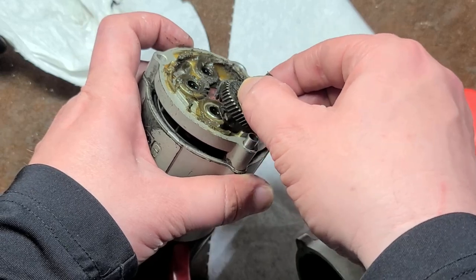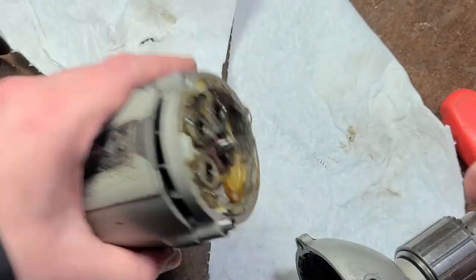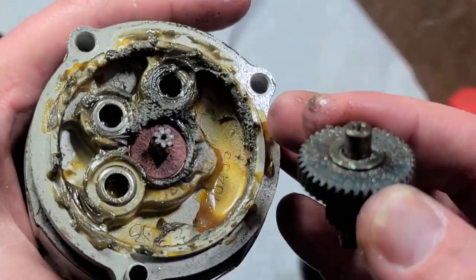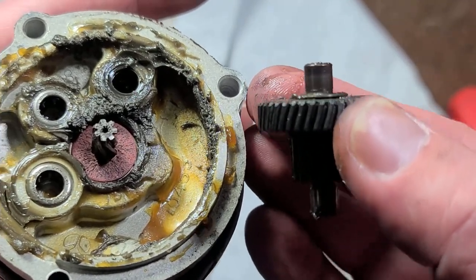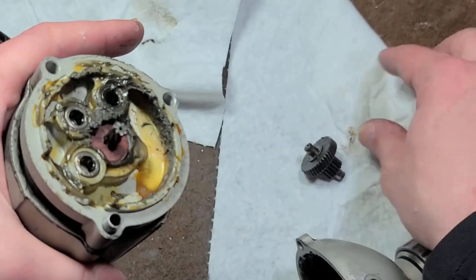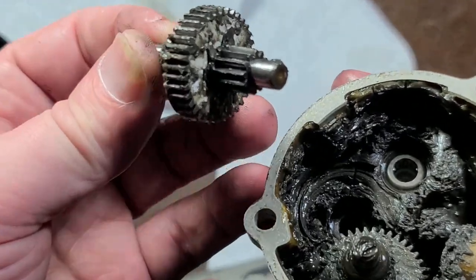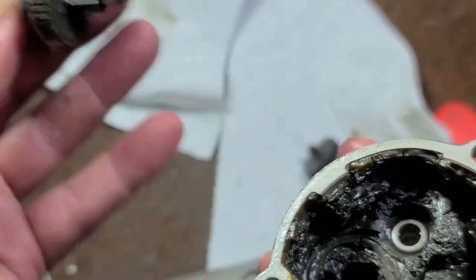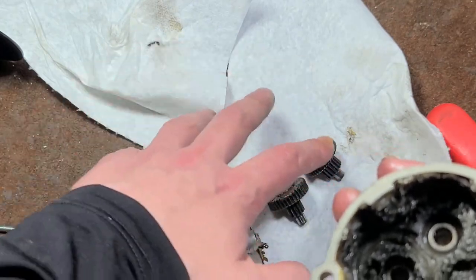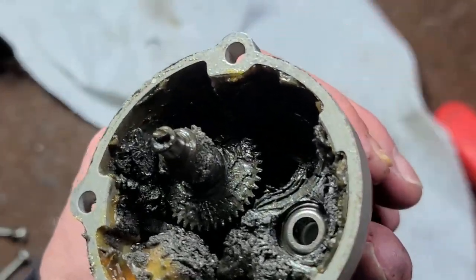There's a thrust washer for this gear. The motor spindle and first stage gears are helical cut, then straight cut on the other two stages. The helical cut on the highest speed stage reduces noise and is a bit stronger, though it does have a slight sliding motion. On the lower speed reduction gears they didn't need helical cut. This is a Porter Cable standard — it's called triple reduction because: reduction one from the motor, reduction two between the intermediate gears, and reduction three from the final drive gear to the spindle. Being a Porter Cable, it's all ball and needle bearing.